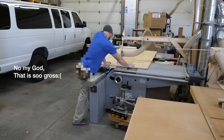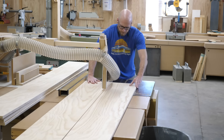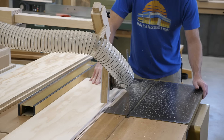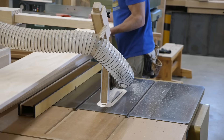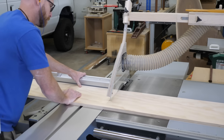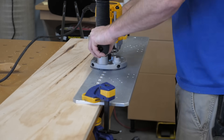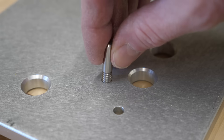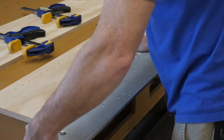Let's shift gears. The workbench top has been set aside — now on to the cabinet organizer thingy. All the dimensions are based off maximum yield, so the cabinet depth is about 11 and three-quarter inches, meaning I get four strips out of each sheet of plywood. The sides are about six feet tall and the shelves are about two feet wide, so I get one side and one shelf out of each strip. One of the three cabinets will use shelf pins and three-quarter-inch thick shelves. The other cabinets will use dados and one-quarter-inch thick shelves.